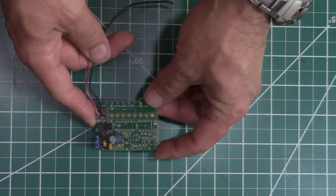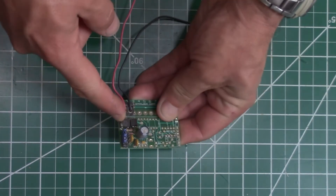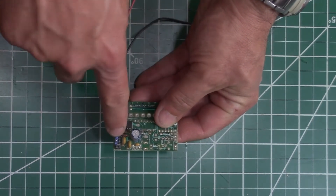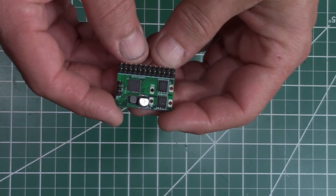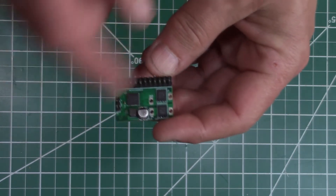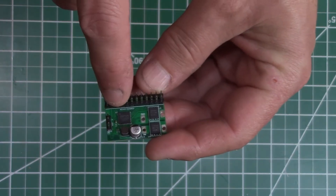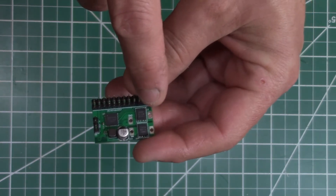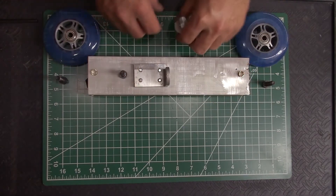Inside that door lock I found electronics which are basically nothing other than a rectifier — four diodes, a FET, some capacitors. I'm going to do something different: I'm going to use my PAC5526 H-bridge reference design. This is basically an ARM Cortex-M4, so this guy can actually do a three-phase inverter, but with four FETs it's a full H-bridge. We have enough parts here to make some damage.